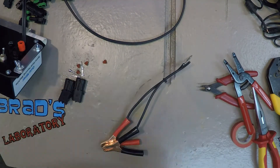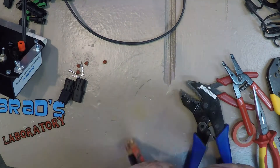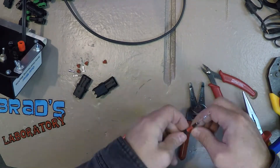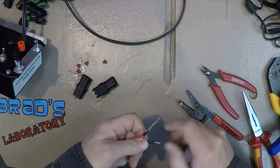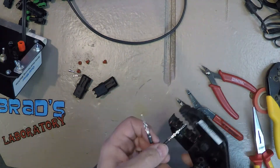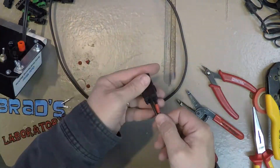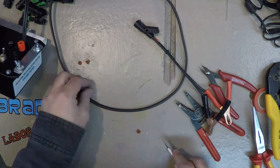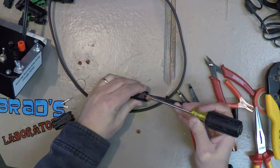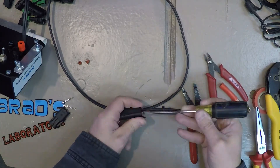Here I'm crimping pins onto the battery clamp leads. I'll keep these with the unit in case we ever go out to the field. I figure out which way is positive, make sure red is going to the right place, trim those leads and stuff them in with a screwdriver — that worked a lot better — then snap the back shell down and we're done.